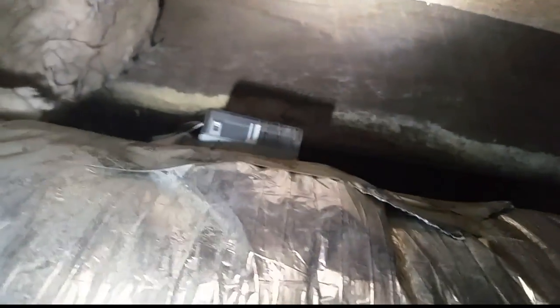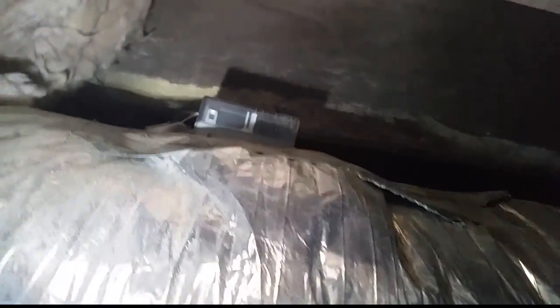I am somewhere in the middle of a lot of flex. As you can see, there's my body lying underneath a piece of flex with ductwork all the way around me. I have to get to this zone damper to see how it's wired. God forbid this ever has to be replaced — luckily you can change the motors out — but it's still a real unpleasant environment. I'm going to check the wiring on this motor and then I can crawl out of here.